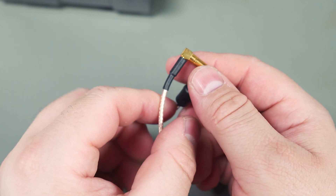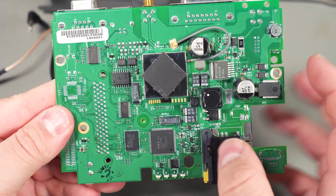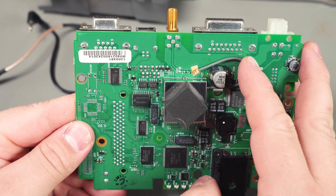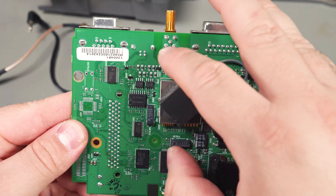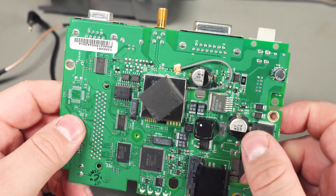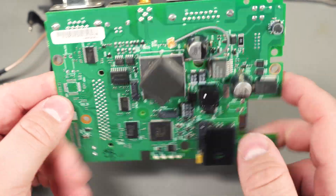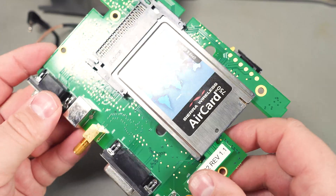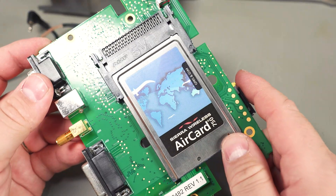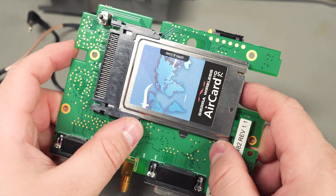As for the main PCB, it's pretty straightforward. It looks like there's an ARM CPU handling most of the tasks. This is probably the RF power amplifier — no, actually it looks like it's the GPS, because you can see there's a little RF cable running right to the GPS connector. So that's a GPS module. SIM card, power supply, and just odds and ends — looks like a serial driver and flash memory. On this side there's a Sierra Wireless AirCard 750, so this is a GPRS/GSM modem. This is what's actually interfacing with the network — it's basically just a box and power supply for this card.